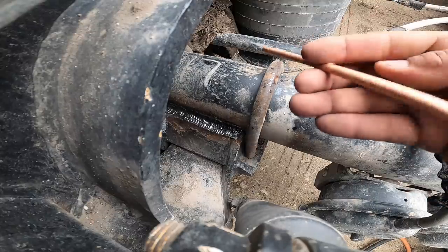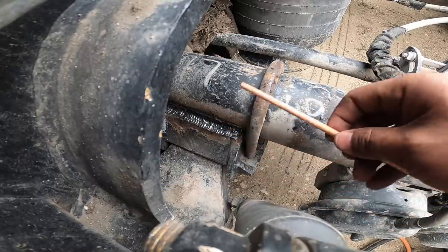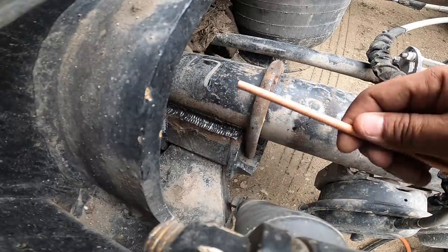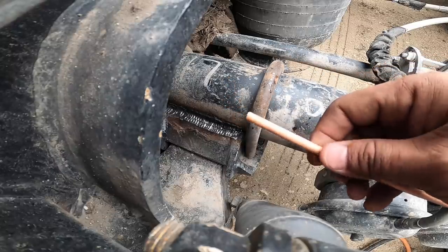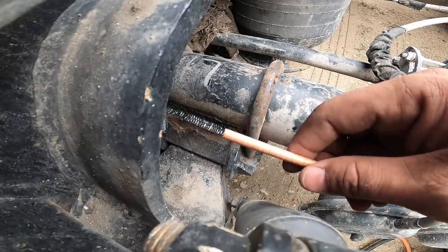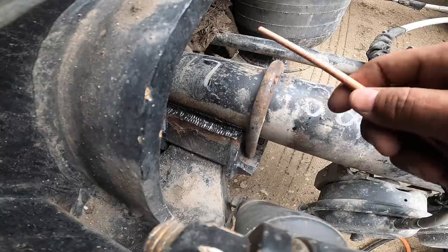Hollow ones work really good for keeping the nose of this really rounded, and that way it doesn't sharpen to a point when you're going in one direction or so. Anyway, this 1/4 inch, I'd like to gouge at about 200 to maybe 220 max. I really don't like 220; it starts to get a little carried away. But at 200, you can get a nice steady arc, a consistent arc without it sputtering too much. So that works really well. All right, welding next.